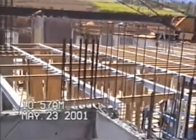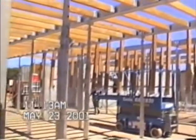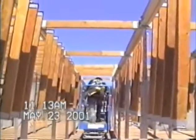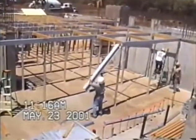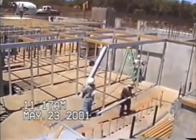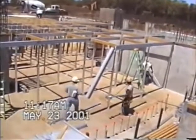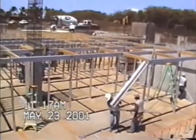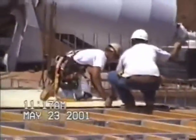After setting the main gridwork, the intermediate joists are set in place using a scissor lift, as the floor is 10 feet high and cannot be reached from the floor. The man is climbing up in the scissor lift to start setting the joists. It is now 3 hours after the start and we have set approximately 4,000 square feet of equipment using the same procedure: hang a ledger, tilt up a post, stabilize with the joist. They are now starting to deck over.